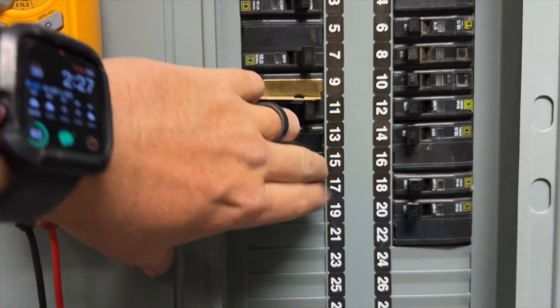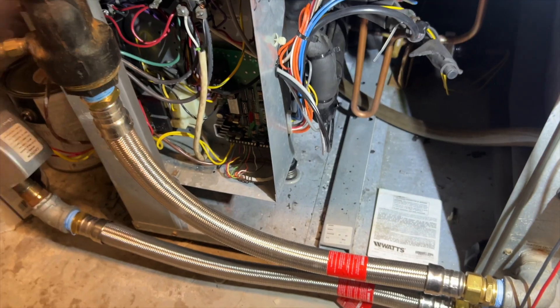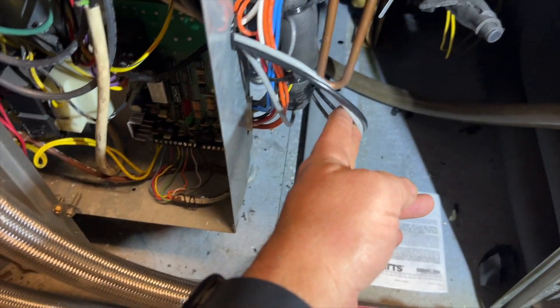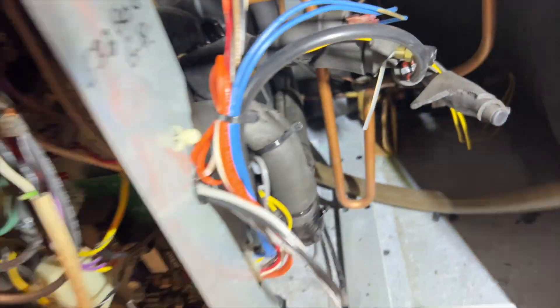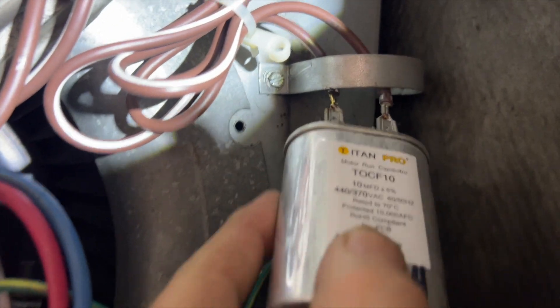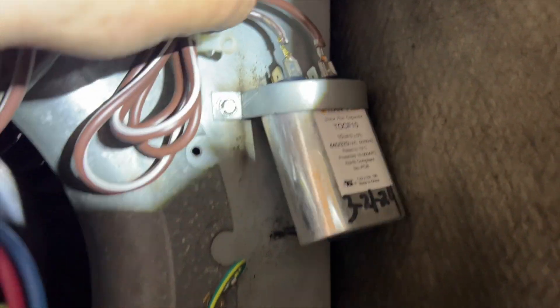Immediate trip. Let's see what's up. Doing a quick visual inspection — looks like this compressor has been changed before, you can tell by the black and gray coloring. Now I'm smelling something. Check this out — this is why you always want to do a visual inspection before you get crazy. Look at this run cap — it's touching metal. That may have caused a short. Yeah, that may have been our issue because you can see it's burnt.